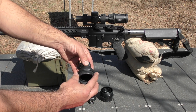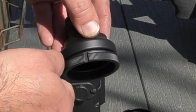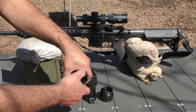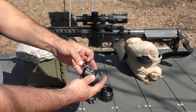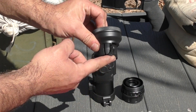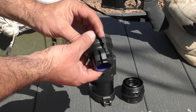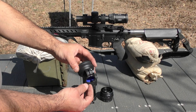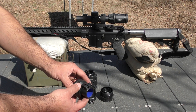I'll put those two back together. It is keyed for a wrench in order to apply torque — I'll just go with super hand tight. The throw lever is two position: wide open or on/off, and when you close it you see that gap close, which applies the necessary pressure on the front housing to make the system solid.